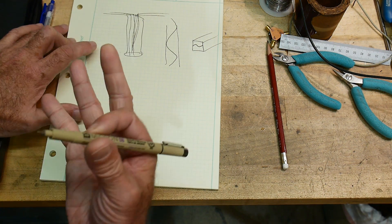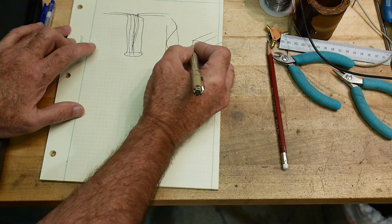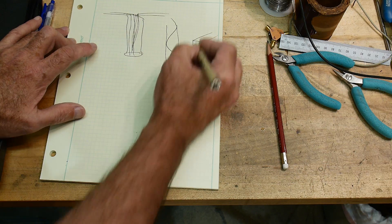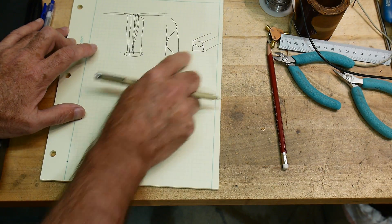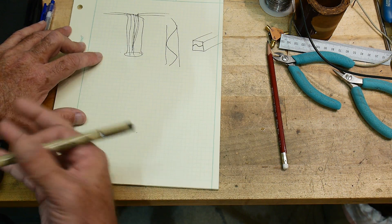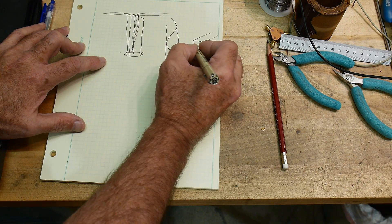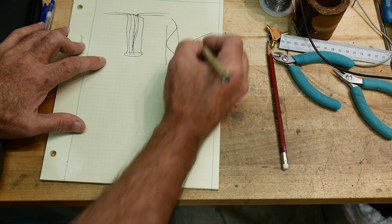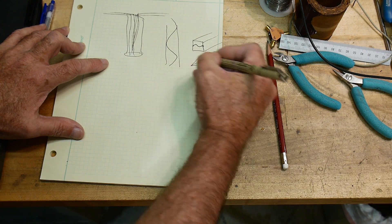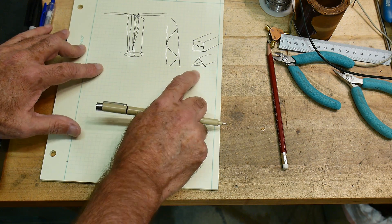You adhere to certain boundary conditions — you need to have zero volts, and the magnetic field must go to zero. The shape and size of these waveguide structures is governed by Maxwell's equations. I remember taking E&M about 40 years ago; we actually had to solve Maxwell's equations and determine things. On the final they had us calculate the size of a triangular waveguide — yeah, go try to do that.